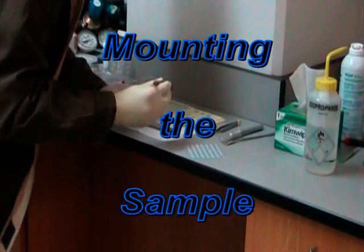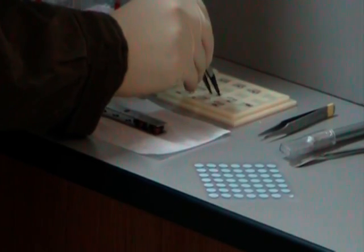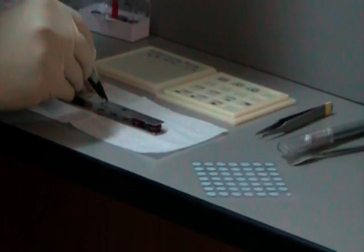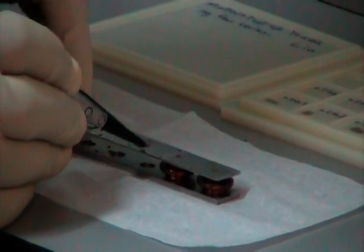We're going to mount the samples now on the sample holder that will carry them into the instrument. I'm just going to use some double-sided tape — the same sort of conductive tape that we use to adhere samples to the sample holder in the microscopes. This is just a stainless steel bar that's going to go into the chamber. The easiest way to do it is with adhesive. The adhesive pumps down fairly rapidly in the vacuum system — it's not a problem.